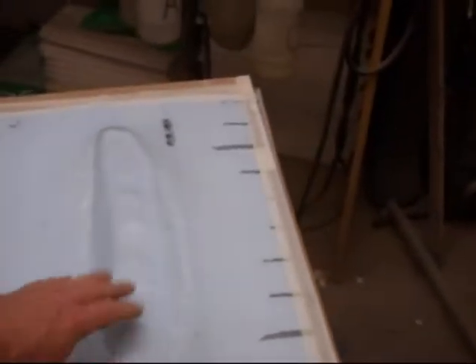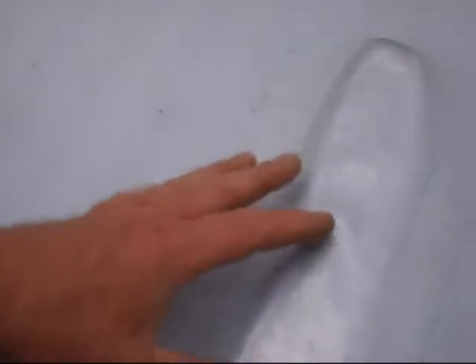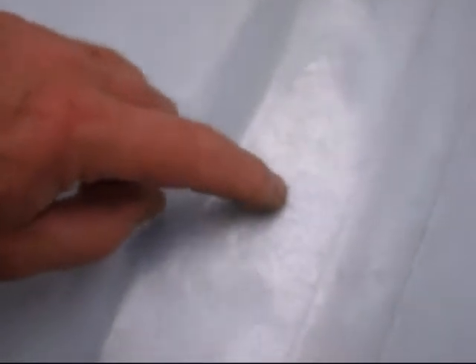My conclusion of this — it didn't work. It worked better having the form underneath heated up, but it compressed the thumb too much. You can see here it's really weak in some spots and stronger in others because it was expanded out too far. It did not work well. I want to put a cap on this whole fan-fold thumb molding experiment, and basically I've discovered that there's no real easy way to do it at home that I can come up with.